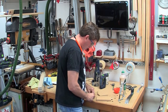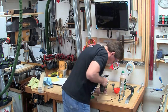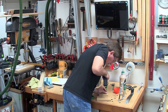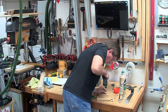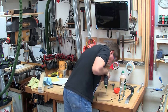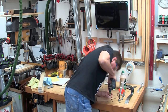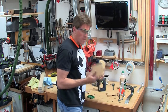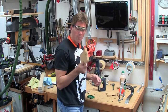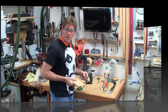Now let's put a screw in each of them. We're going to let the screw stick out a little bit so that we have a way of prying it off — we'll put it in about a half inch, which is probably about the dimension you'd use if you're actually making a cabinet with this. I'm going to set this aside so it gets at least about an hour for the glue to firm up — more of a real-life situation where the glue has hardened up — and then we're going to try prying it a little later.